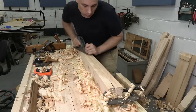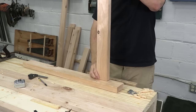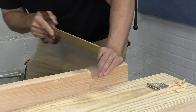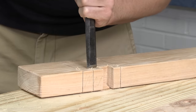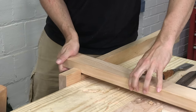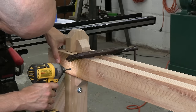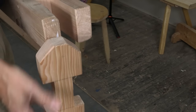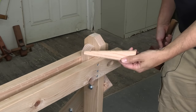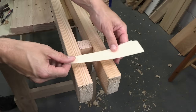I made the bed out of my straightest wood. I clamped both pieces together and planed them until they were dead parallel and really smooth. Then I used the ends of the bed to lay out notches in my uprights. Cutting the notches is straightforward saw and chisel work. It's a simple joint, and after a few minutes my bed pieces were fitting nicely. Fitting the bed to the frame was challenging, but everything was straight and square, so I made the two little spacer blocks and screwed them to the bed. Now the bed slides right onto the leg assembly, and all we need is the wedge that locks it in place.